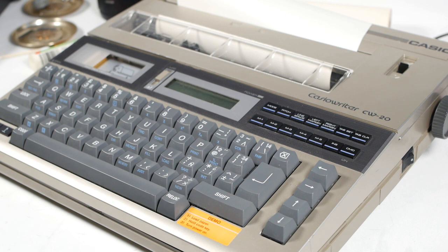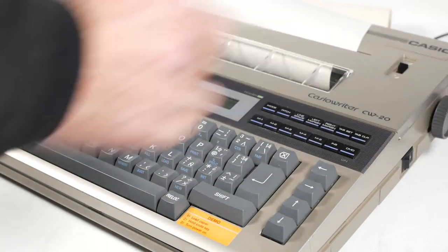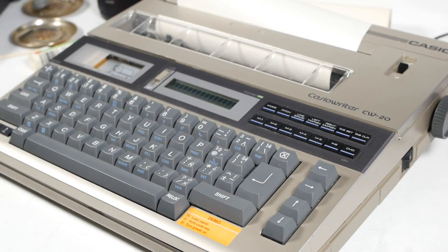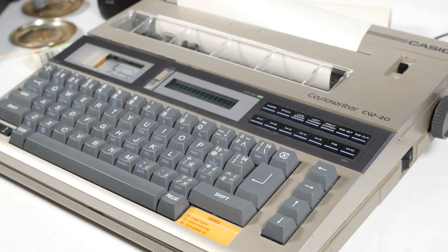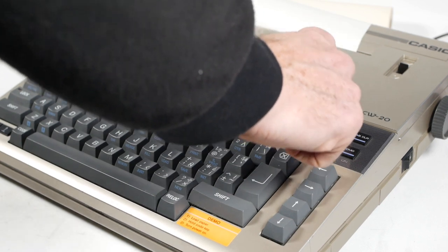So I stripped everything apart again, and this time cleaned all the contact pads on the membrane sheets, then reassembled the keyboard to try again. And it works! Well, more or less, anyway. There's still a few temperamental keys like the S key, and I can't get the tab set key to work, so I'll probably do a little more work later, but it's loads better than it was.